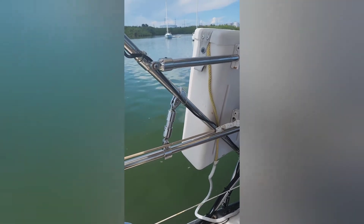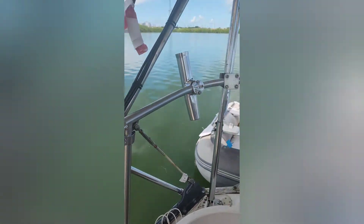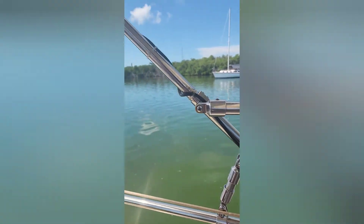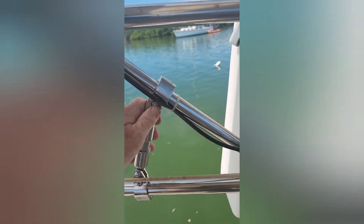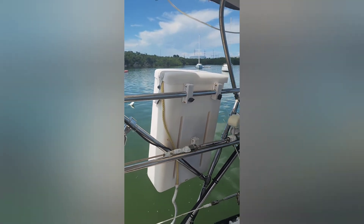Now that we've added our braces, we still have a little movement, but as you can see it's the entire structure moving now — all the way back to the dinghy davits — because now everything is tied into one unit. This gives the bimini four points of attachment instead of just two, and it reduces the length of the arm's bending moment off this brace, ties everything together, and makes it stronger. So we're looking forward to surviving many a storm.